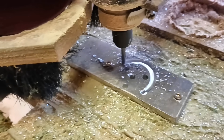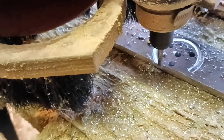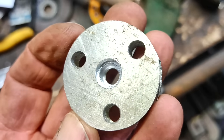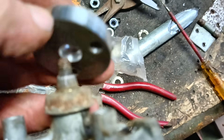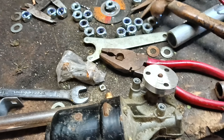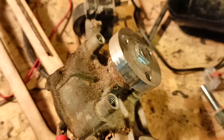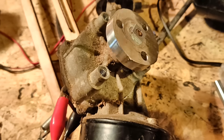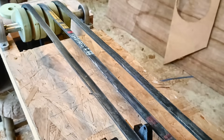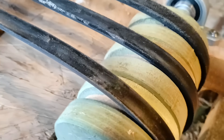I made an aluminium plate to fit on the CNC router — my first time milling aluminium on it, and it worked fine. I used various drill bits to get the hole in the middle close to the right shape and then whacked it on, hoping the knurling would bite into the soft metal. In hindsight I shouldn't have whacked it on at all because now it makes a funny little noise and I guess it wasn't great for the gearing inside — but it is still going. I was then able to attach various size pulleys until I found one that gave me something like the right speed, except I don't actually know what the right speed is — I've only ever played whack-a-mole once in my life, and that was 40 years ago in the States.